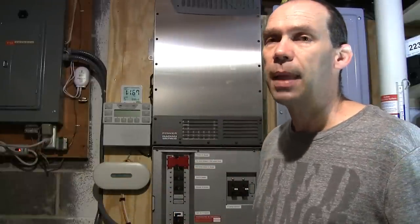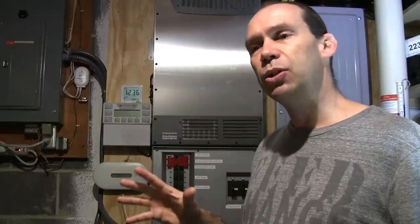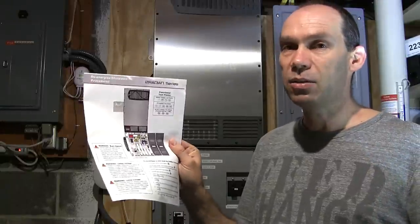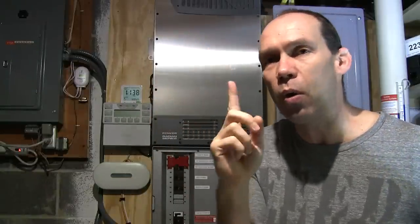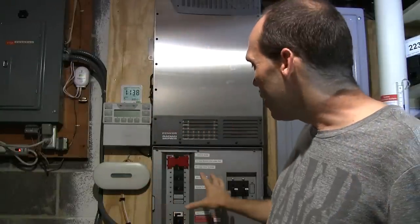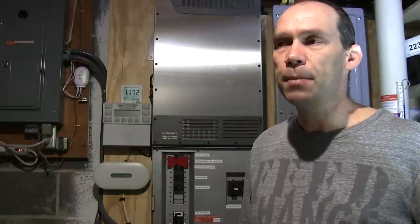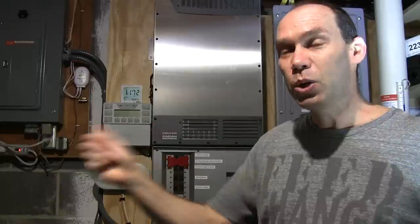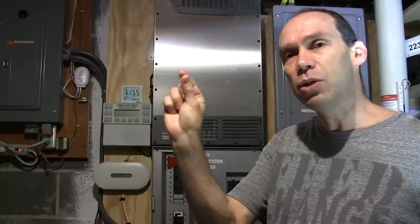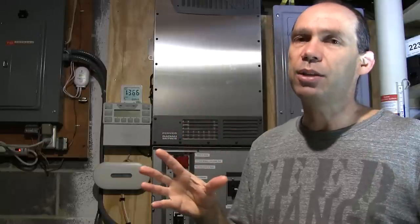I realized that if this situation had been a little more panicky and I needed to act more quickly, I might not have gotten my hands on the documentation quickly. Also, the switches aren't that clearly labeled for which way is on and off in an emergency when you're panicking. So I'm going to label these switches clearly — some circuits are labeled, but which way the breakers are on and off might not be clear. I'm going to put my own labeling, noting which switch goes first and which goes second, which can be very helpful in a panic situation.